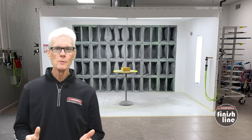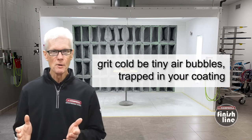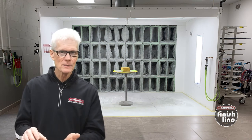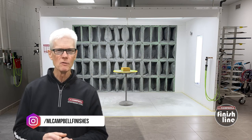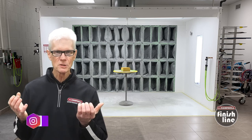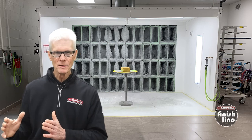The grit in your coating may actually also be tiny little air bubbles that are the result of air entrapped during the atomization process. When all the little particles of paint you've sprayed out of your spray gun hit the wood, they trap tiny pockets of air between them, and those air bubbles need to rise to the surface and resolve. If your coating dries too quickly before that is able to happen, those bubbles may rise to the surface and form little tiny domes that appear as grit in the coating film.